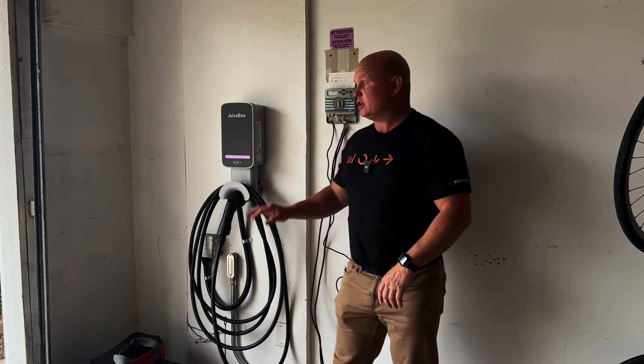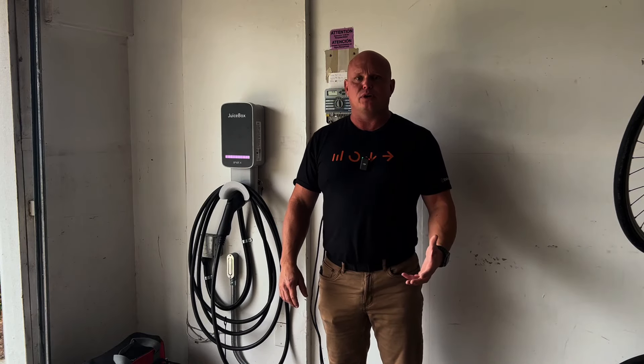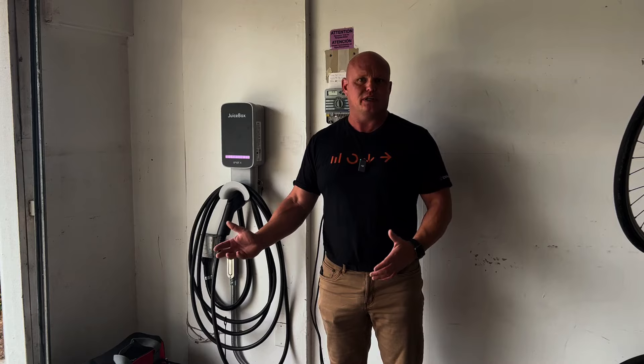Now we're doing a follow-up. Now that we're releasing the Enphase IQ EV charger, we're on site and we're going to upgrade the existing charger — the JuiceBox — to the Enphase charger. This is going to benefit the homeowner in the sense that when the solar is producing and the loads are not using all the power and the battery's full, the EV will be able to take all that extra power and charge the car. So they're actually able to keep more of that power on site versus exporting it to the utility company, where they now, with NEM 3.0, have a lower feed-in rate, and it's just a better ROI and a better investment for the customer.